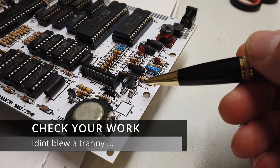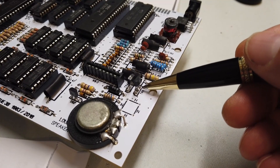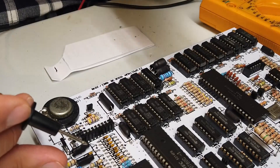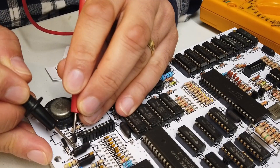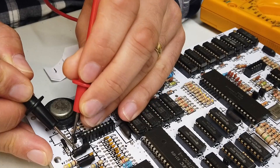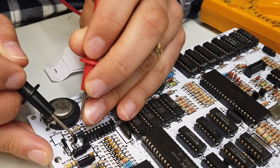I'm having an 'oh my god, I'm such a muppet' moment. I've just tested the power supply and it's not quite giving out what it should be. I'm looking at these transistors — I've got them in completely the wrong way around, 180 degrees inverted. I've just looked at the pins on TR4 and I've got the meter on continuity test. Guess what? Two pins on TR4 are permanently connected. Now that could be a shorted coil. The other two pins on TR4 are OK. That could be a shorted coil or it could indeed be TR4 itself. So let's pop TR4 out and see if that continuity error goes away.